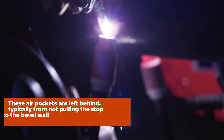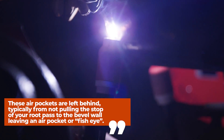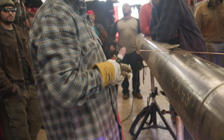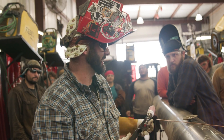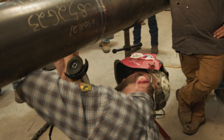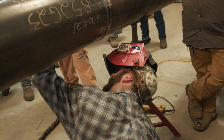That little pot when I came up to the side had an air pocket from whenever I stopped that root pass. So if you're ever putting your hot pass in on your root and you see something pop back at you, it's because you left a fish eye on a tie-in — that's very much likely the case. One other tip: when you're on the top and bottom tie-ins, don't just start right where he left off — start ahead of it. Gotta communicate with anyone in the way.